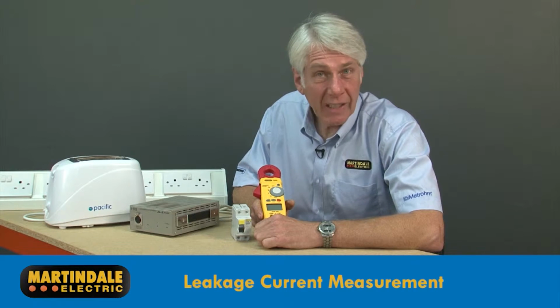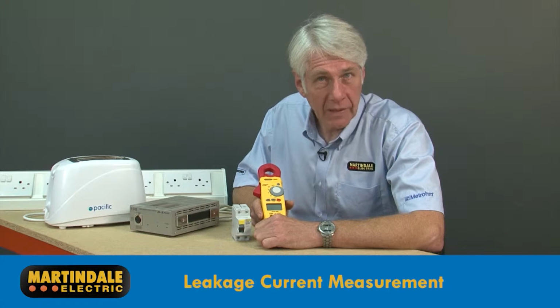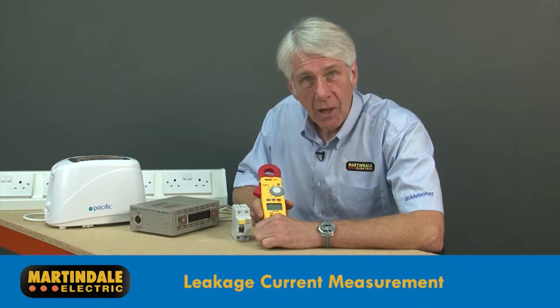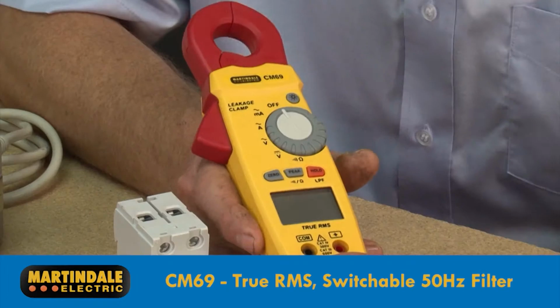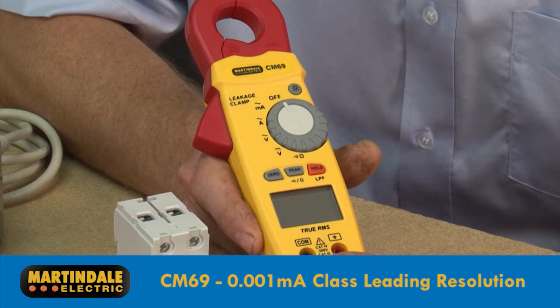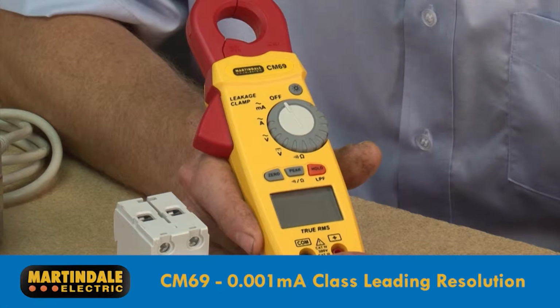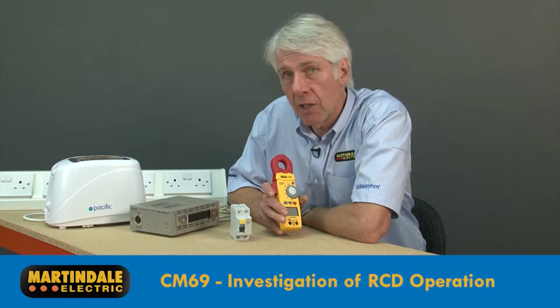In this video, we're going to demonstrate some applications for earth leakage clamp meters using the Martindale CM69, which has true RMS measurement, a switchable 50 Hz filter, and a class-leading resolution of 0.001 milliamps, which is just 1 microamp in the lowest range. A common use is for investigating unwanted RCD tripping.